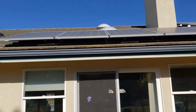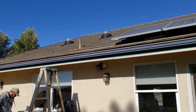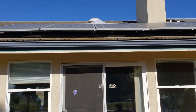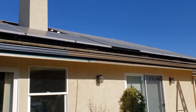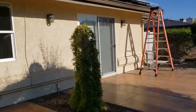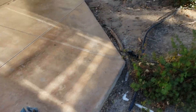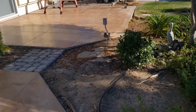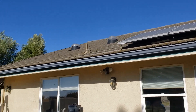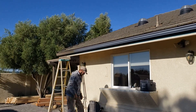The gutter has to come down — there's no other way to attach the patio cover. The rain gutter is roughly 40 feet long and it's all got to get out of our way. We've got to attach the new patio cover to that two by eight fascia, put the two by six tongue and groove on top of it, some new roofing material — a real roofing type walking surface — and flashing so we don't have any leaks between the patio cover and the house. There are five posts here. Right now we're working on getting the gutter off. Kevin and I have got all the screws out, now we just have to pry the flashing loose.